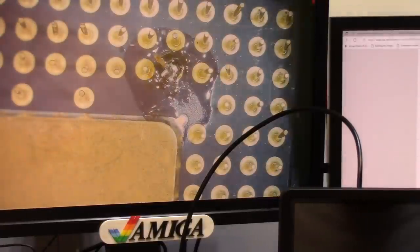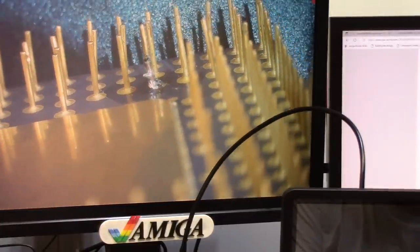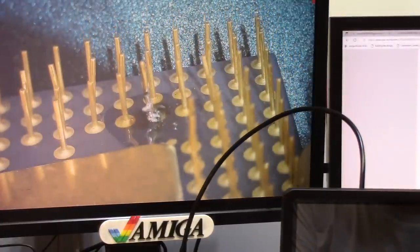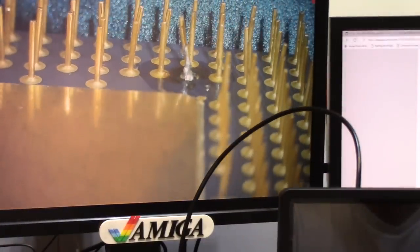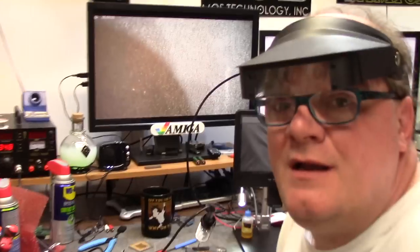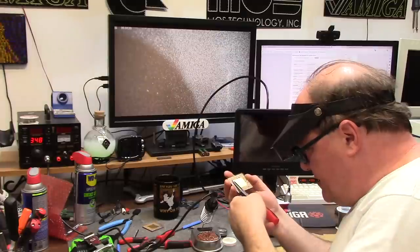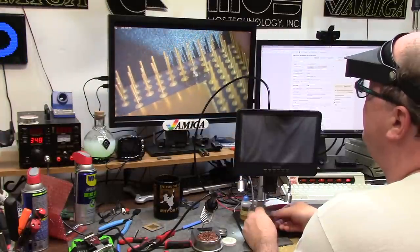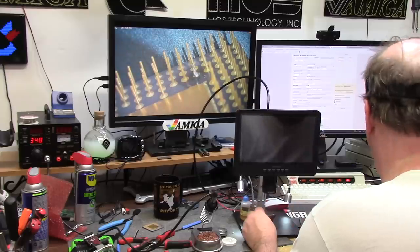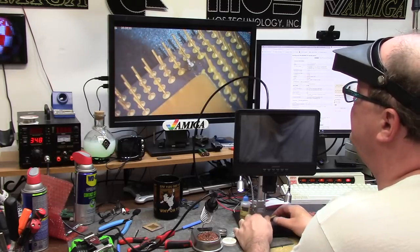But let me see if I can straighten it. It's not perfect. It's crooked as a politician. I need to get it in the center. But the theory is sound. All right, it's in the center. Yeah, it looks horrible. The idea is the pin is on, and all I need to do is be able to touch the socket one time. One CPU pin. Magic legs. I want to take a picture for Mr. Q. And that is how you totally put a pin on a CPU.